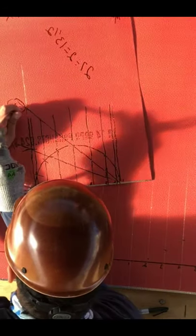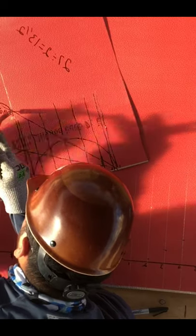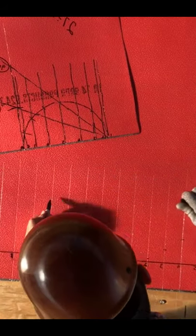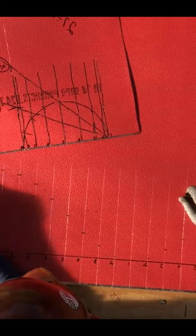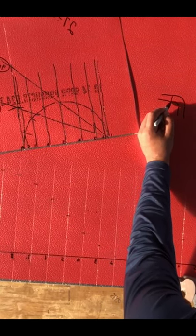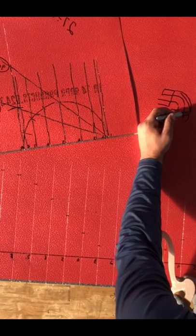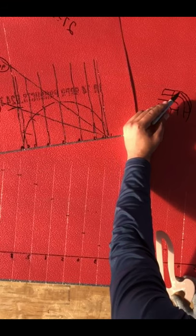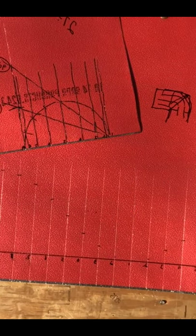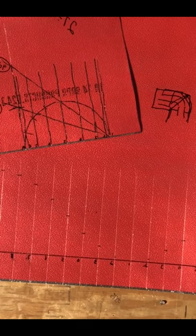If you see how I'm marking it, I'm marking above the horizontal black line on my sheet of metal — not top and bottom, just above it. So you don't have to do it like you're doing a 90 or a gore; only mark on the top side. Once you mark all those lines, you want to connect them. Keep in mind what a stovepipe is — when the pipe is insulated and you don't have a throat, or you have a short-radius throat, you can put a three-part 90 or a stovepipe in that situation. For this pattern, we're doing the stovepipe.